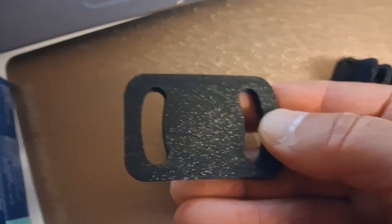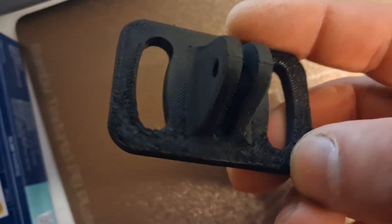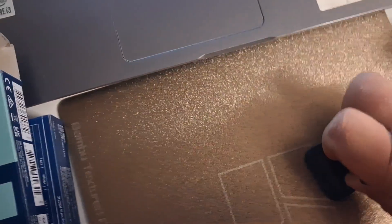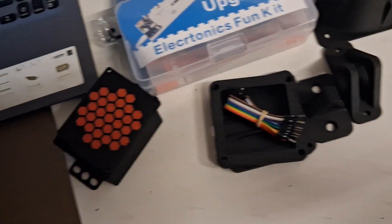Normally you've got to peel them off and they're like 'get off!' — these are just falling off. So what I did was I turned the heat of the bed up so it stuck more, and slowed the speed of the printer down. That nasty bit there — that's not my printer fault, that's the guy's print file I've got this from, because this was the third attempt. These are the brackets that's supposed to hold it to the rig.